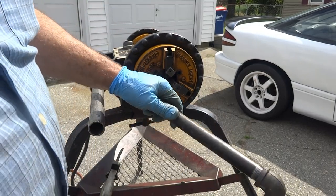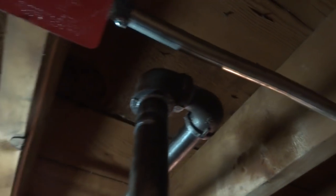Be it. It's my offset piece. All right, guys, so I come over here off the tee. I put a street elbow and a regular elbow. I gotta put a hanger on this thing yet, but just come down to the gas cock, the union, and right into the unit. I gotta change this control to one that's got a low water cutoff, and I gotta do this wiring. Then when I'm done, I'll be able to just use that same control and hook this wiring up instead of going up and down through that control.